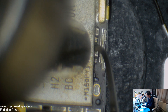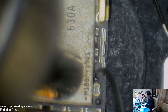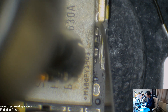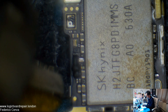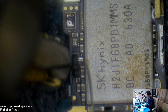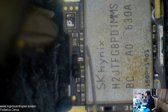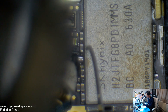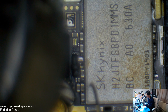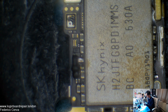Get in between. The reason why I like this — you can use a blade, but if you use this you've got that hook. So you can go downwards like that. You don't need to get your blade and get all uncomfy. You're just in one spot, breaking away the underfill. There we go. You just come in with your hook and you clear everything. Nice and easy, just like that. No tension, no pressure — you just come in and slide it like this. Nice and smooth.